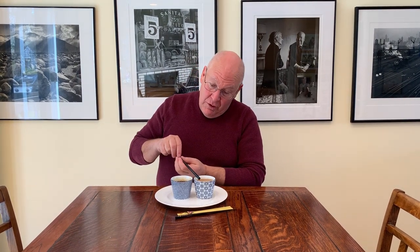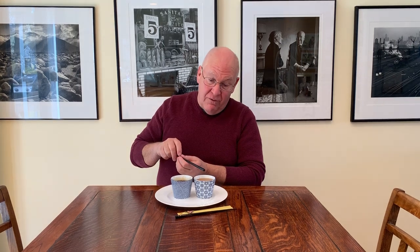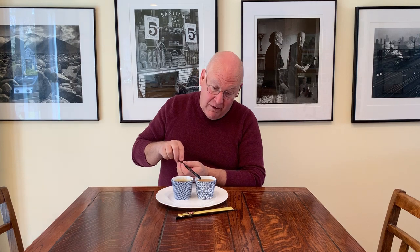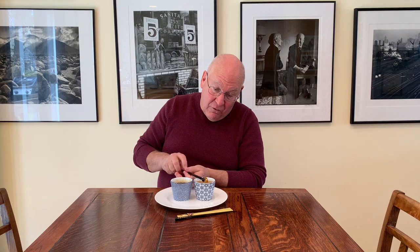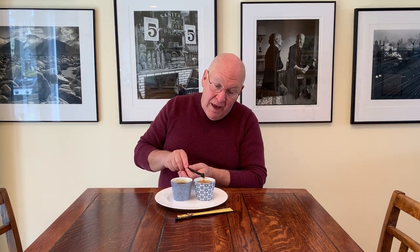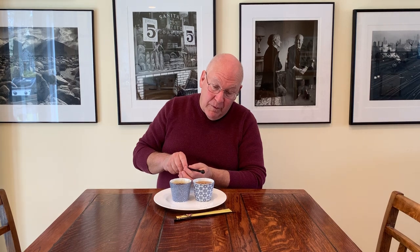So you want to get on the ledge of the furnace — the cup. Use both hands, because in gathering at the furnace we use both hands. You could certainly do this with one, but I recommend two hands. You lower it in about an inch, you turn and speed up, and as you get to the horizontal position you slow down. Let's look at that from a couple of angles.